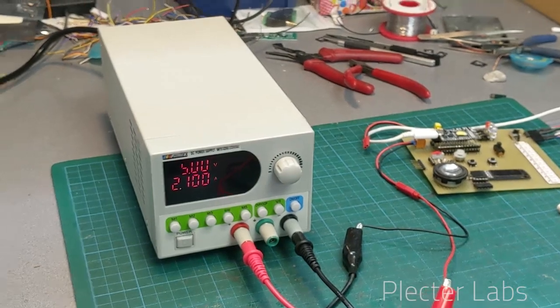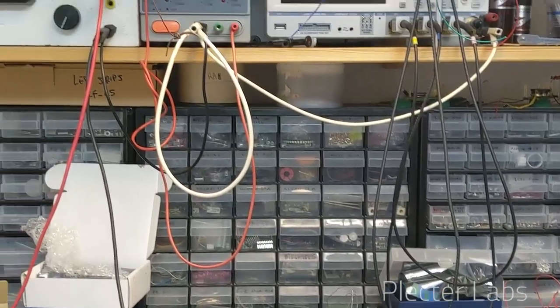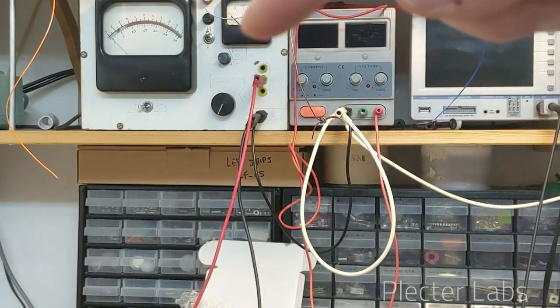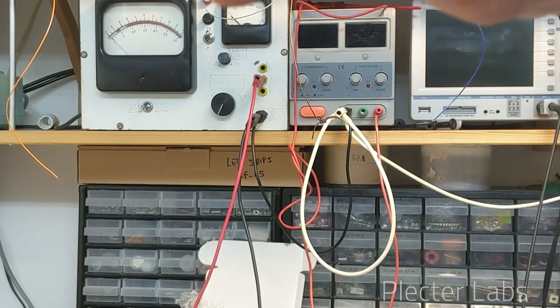Just to give a quick look — here are the ones I'm using usually. This one is a bench power supply that I built when I was 15. I'm 45 now and it's still here: 30 volts, 2 amps, with three different calibers — 100 milliamps, 500 milliamps, and 2 amps.